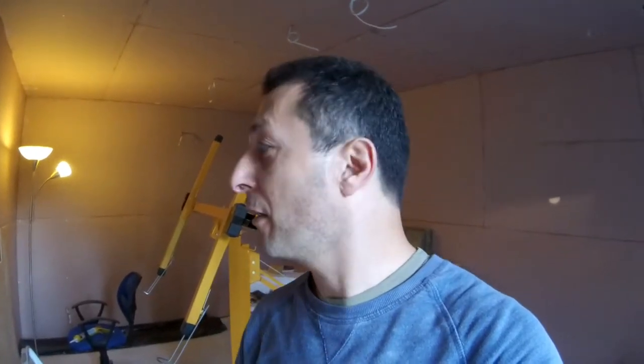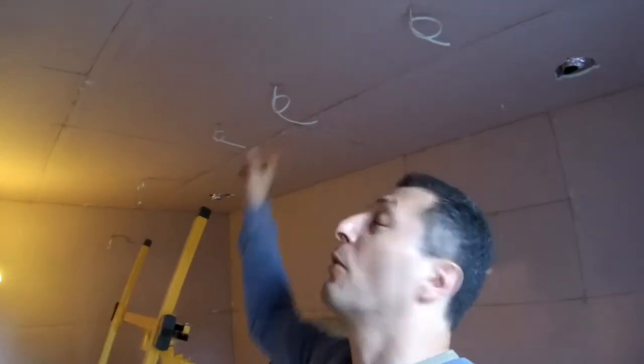And then when I put the next layer on, underneath it, it's already been sealed, including all the power points, all the lights at the top. So all of them have been sealed so that it's as airtight as I can. And I had an extra tube left of the caulking tube, the silicone tube.